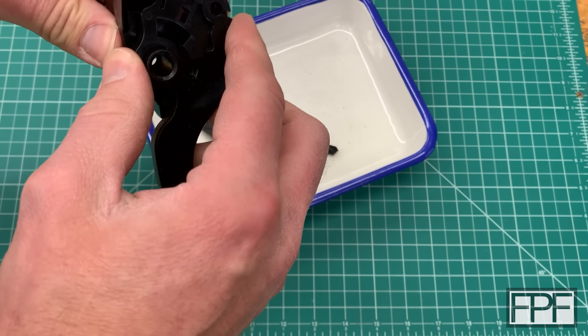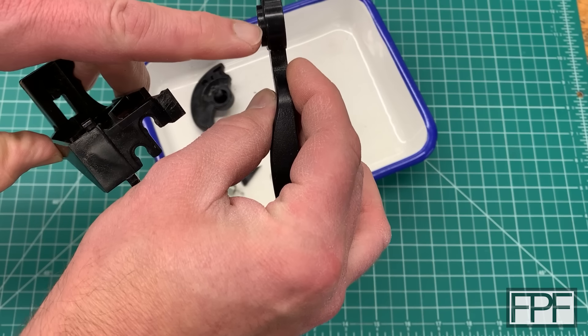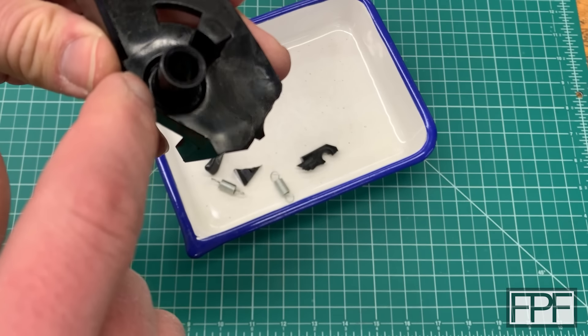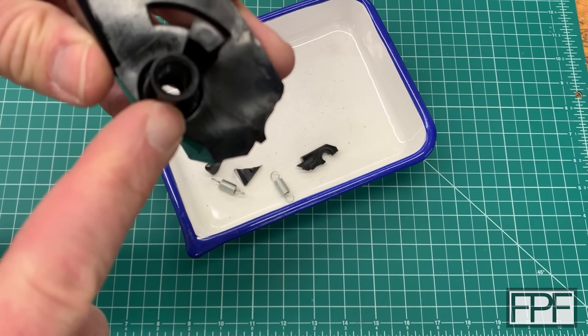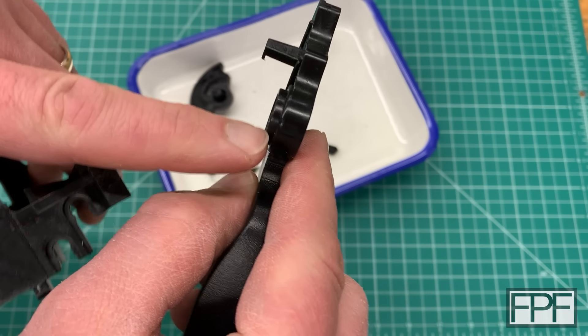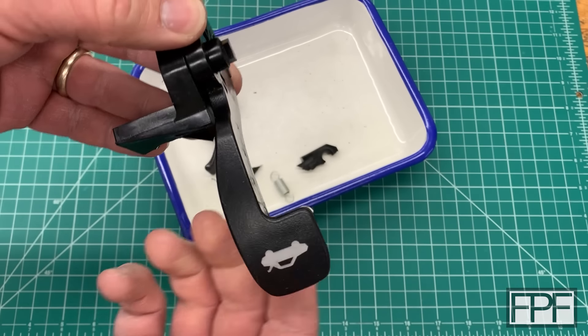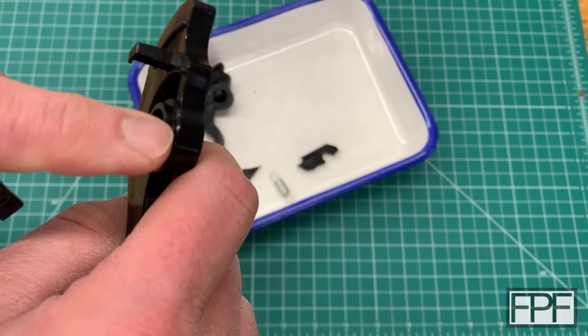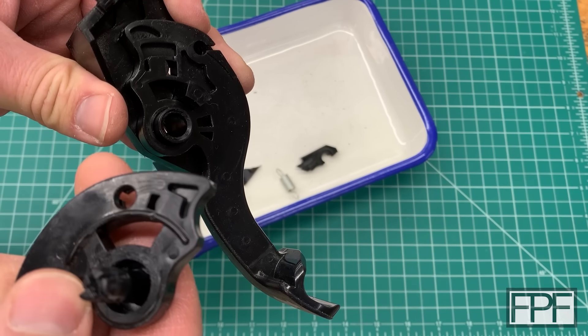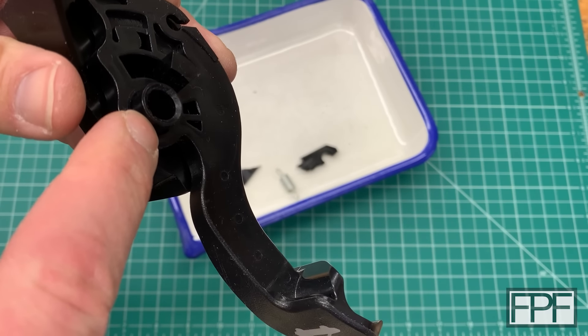So this has a section that keys into this bore down here — a counterbore — that also has a rod coming out of it that is tapered on the end for the other piece to fit into. This actually rotates. It hinges on this raised section here. So this one fits on first and swings on this surface and the inside of this bore. Then this one fits over it — that one also swings on the OD down here in this bore. There's some grease on this as well. I'll have to remember that when I put this back together, it should have some grease on it.